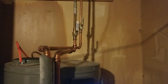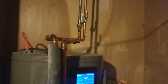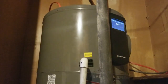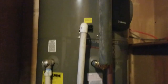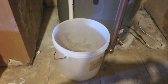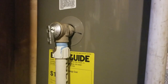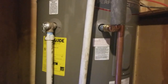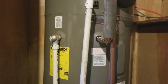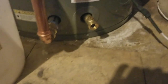Getting familiar with our installation, we'll start with the water supply valves. At minimum you should have a valve on the cold water supply line so you can shut off water to the hot water heater. You have your power coming in, and since this is a heat pump model, we have a control panel. Any type of heat pump typically contains a way of draining off water which condenses out of the air as it is cooled — here you see the condensate line exiting the water heater, where it should drain into a floor drain or outdoors. This unit is currently draining into a bucket since the exterior line has not yet been installed.